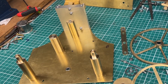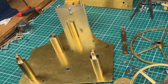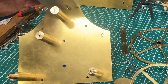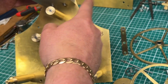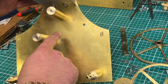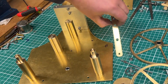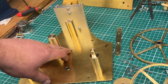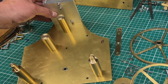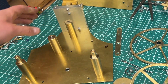We're here for our first assembly and all the wheels and pinions are nicely attached onto the arbors using shellac. I did make one tiny mistake — just a couple of days ago I cut all the way through the front frame into the back frame, intentionally at the time, for the minute wheel. Then I stupidly realized that the minute wheel actually runs from the front plate to just the standoff pillar, so I didn't need that hole. If anybody has a tip on what I can do with that hole to get rid of it — or just leave it there — maybe I can use it as another mounting point in the back plate.